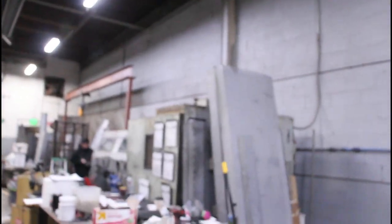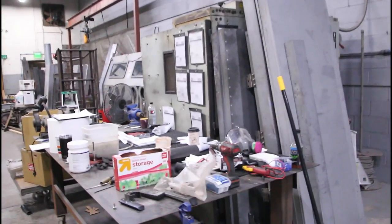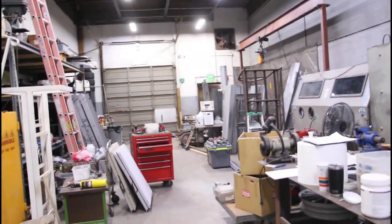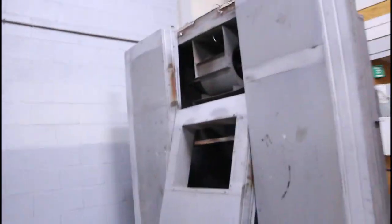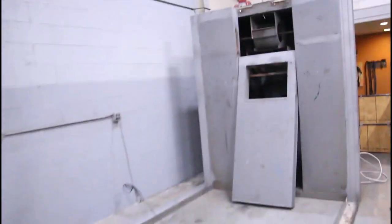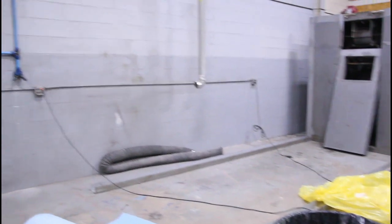And then I organized yesterday all the new oven panels. We have our wall panels there, the back panels, two front panels, and the doors. We have all the top ceiling panels over there still. I'm waiting for a seal and some high heat silicone. These panels kind of warped over time, you can see that. So I bought a new seal to go in between the panel and the burner box, so that's going to be nicely sealed up. We're at a standstill for the oven until tomorrow, but once we have that, it should go pretty quick putting everything back together.